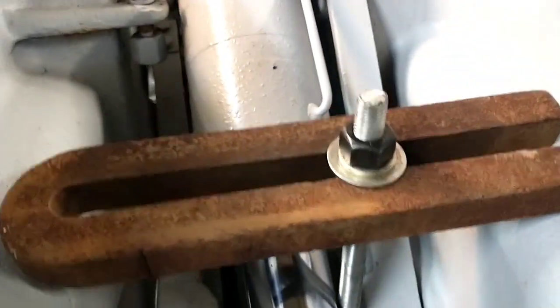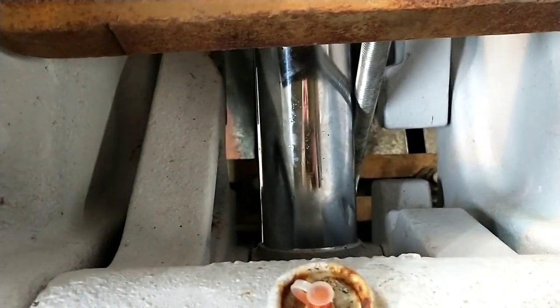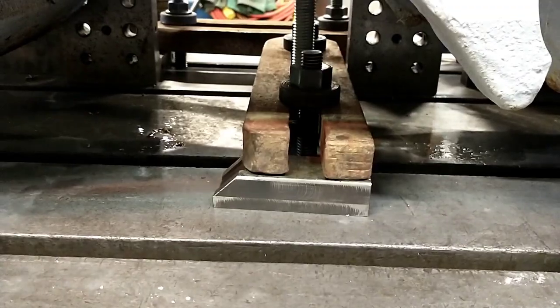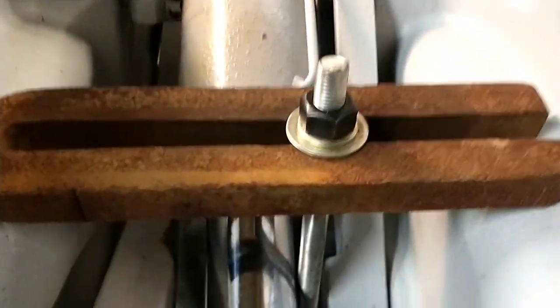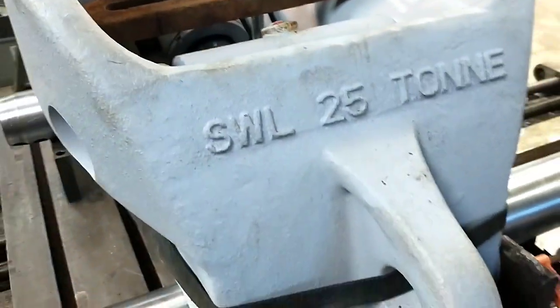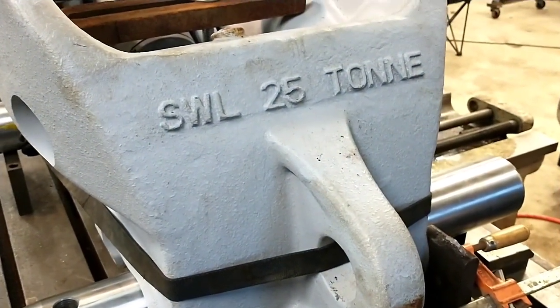And then, this was exciting because none of my T-slots were where I needed them. I'll show you what I got in here. There's not much space to get down through here with any tie-downs. So I ended up taking one of my tie-downs and creating a bridge down here that crossed between my T-slots. And then I was able to put a T-nut in my hold down to get another tie down where I needed it up through here. So I'm hopeful that that should be rigid enough.